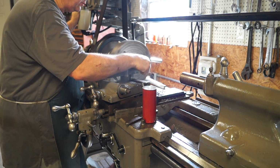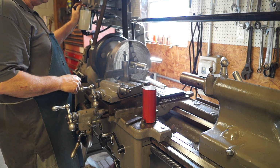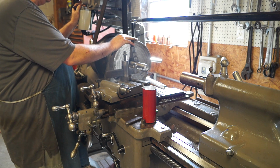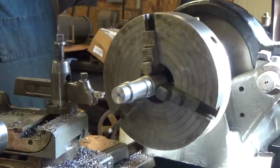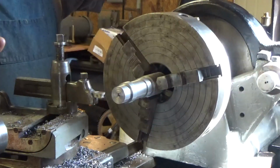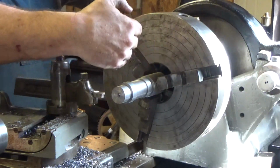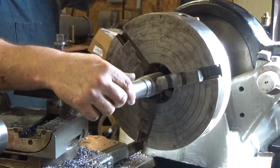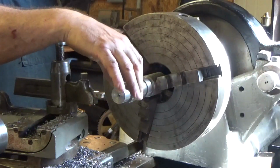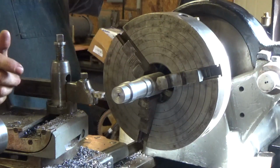Now I've just honed this cutter, and the lathe probably. Let me warm this lathe up a minute, and then we'll come right back. So what I said, we're going to cut these 2 registers, measure them, and see how close this lathe is cutting. Now I expect to have a few tenths off. That's what happened over on the Kingston. Since this one's a couple of tenths wider, it's probably due to a little bit of flexing, so we'll see.